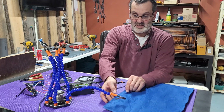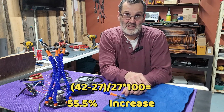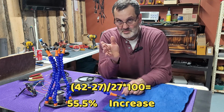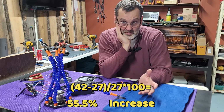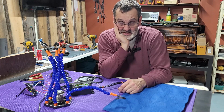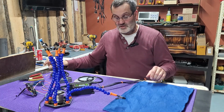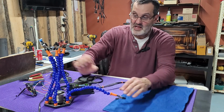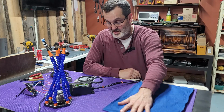We just care. I slid this underneath, put it there, and it went from 27 gauss to almost 42, 43 gauss, 42 and a half. So let's go from 27 to 40 gauss. That's like an extra 12 gauss out of 27. So that's amazing. That's a huge increase for nothing. So if you take the maximum gauss around the coil, I think I was pushing close to 80 some odd gauss out of this, right?